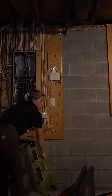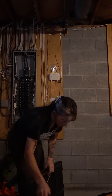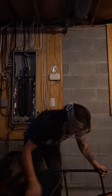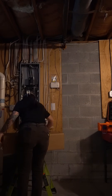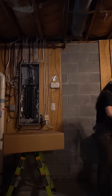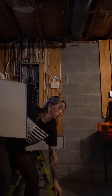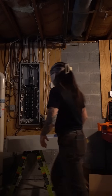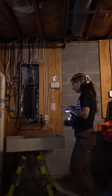Welcome back to my channel. Today we will be installing a 24kW generator with a 200-amp service-rated transfer switch. I'm going to take you through exactly how you install an automatic transfer switch along with your service. The main concept is removing the main feeder wires out of the main service panel and transferring them into this transfer switch, and then the transfer switch — as your main disconnect — brings wires back down into your service panel. When the power goes out, the automatic generator senses it, flips the generator on, and calls power from the generator into your panel.